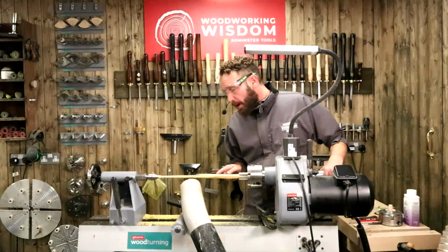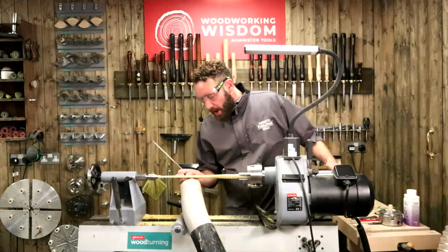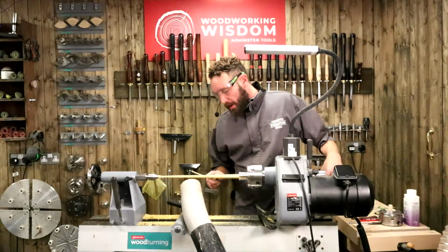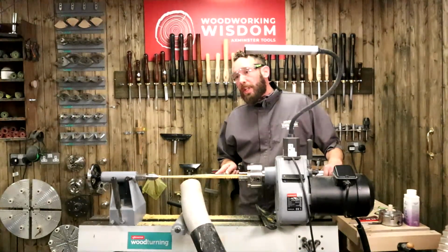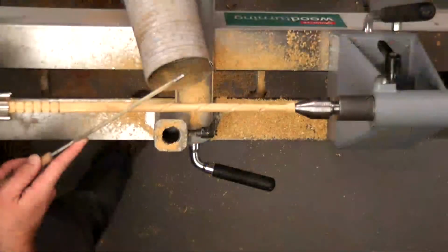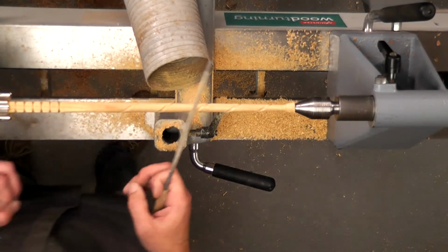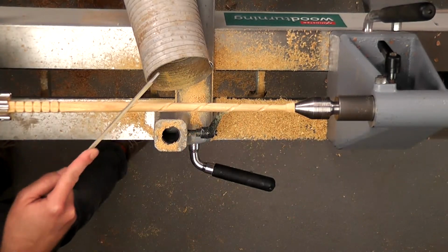And what I'm doing now, I've been right the way along and tidied up the bottom face, and we've got a slight ragged edge where the file's just been hitting on the side grain, or the end grain. What I'm going to do now is just throw the angle over. So let's go overhead. At the moment we're cutting it like that, but I'm going to bring the angle over to try and open up this spiral a little bit. So just throwing it at a slight angle.